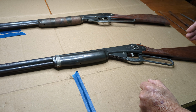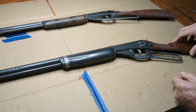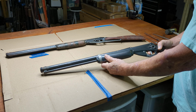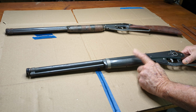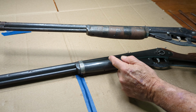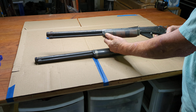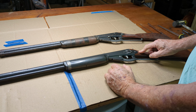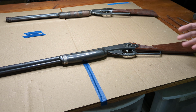So now, the bottom line is the customer sent me the gun because it doesn't work. Well, whenever we get a gun in here at Restomod, we like to make sure that's in fact true. So let's see what this guy does or does not do. Gun cocks, trigger engages. When you pull the trigger, ooh, not much happens. And crucially, an important thing didn't happen that's supposed to happen because this is a Ricochet rifle. We'll grab this other derelict example out of the Remuda here, and I'll give you an idea what it should have sounded like. When you fire the gun, you should get the two effects. You should hear the whiz, and it should actually shoot a BB. So now we know this one doesn't shoot, and we know the customer told us it didn't shoot, so we verified that.